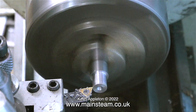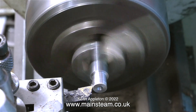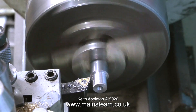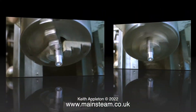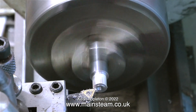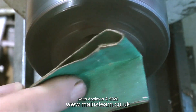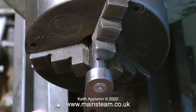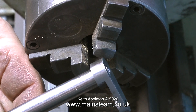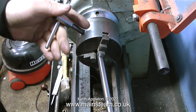This beginner has had about 45 years of experience. What I should be doing is taking measurements all the time with the micrometer, then rotating the lathe handwheel and looking at the graduations — for instance taking one thou off on the handwheel. Remember: if you take one thou off on the handwheel it's really removing two thou, which is very confusing at first. I didn't take great pains with this one — this piece of mild steel is just going to my spare pieces box.